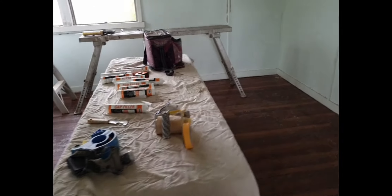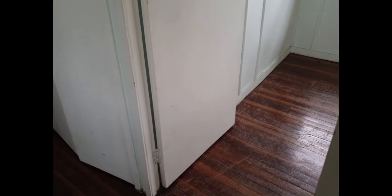We're going to be picking down the sides of these bits of timber. I've just started gapping these areas here. We're going to bring the ceiling paint down to the top of the doors and to the top of the windows — all that'll be white, painted in a low sheen acrylic. All the doors will have to be a water-based gloss. There's water-based gloss on there now. Lots of the skirtings obviously need picking out.